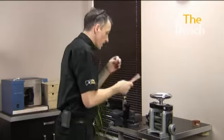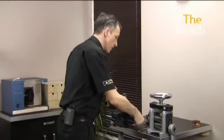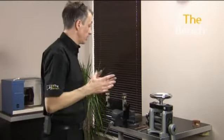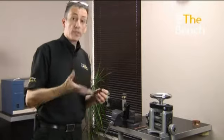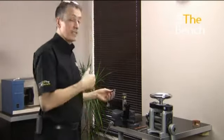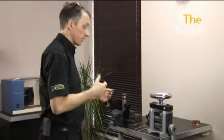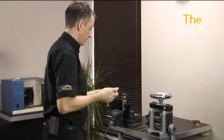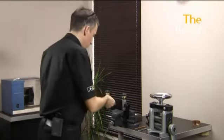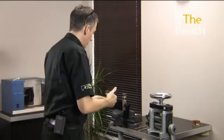There are lots of techniques we can use this corrugator for. As mentioned, you can tighten one side and leave the other loose so the corrugation fans out — great for fan shapes. We can also do something called cross corrugation, which looks absolutely fabulous. On the 0.3 millimetre piece from the first demonstration, I'm going to anneal it first because the corrugation has work hardened it, then dry it and show you the cross corrugation technique. The corrugations currently run in the direction it was first passed through.